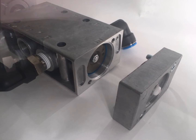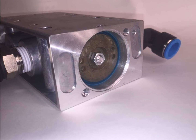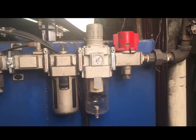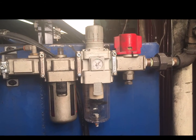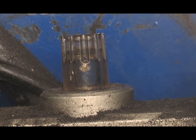The spool glides back and forth in its channel on rubber O-rings. This action is made effortless by a continuous flow of oil through the air system and, in ideal conditions, this valve will last decades. But if the flow of oil is disrupted and the valve runs dry, it will wear and may become sporadic in its operation. This is why oil is so important to the operation of our hammer.